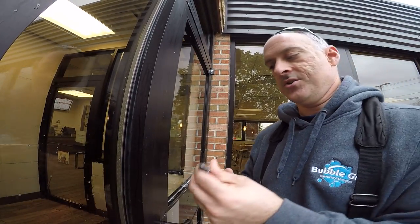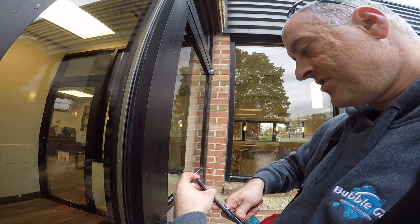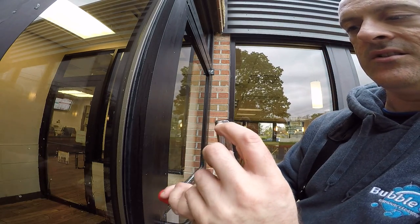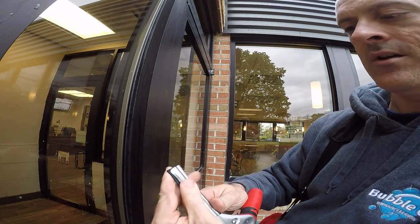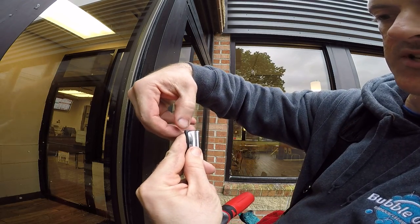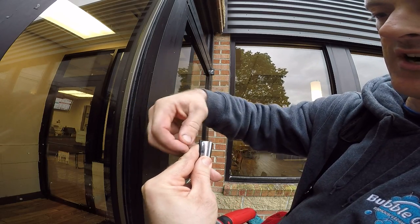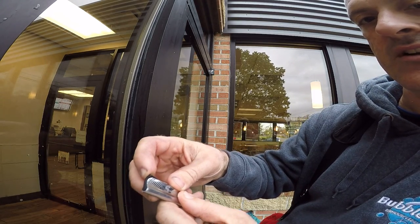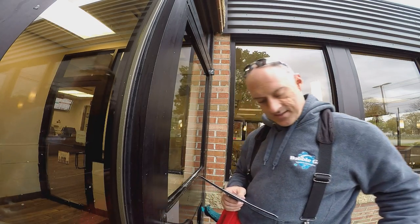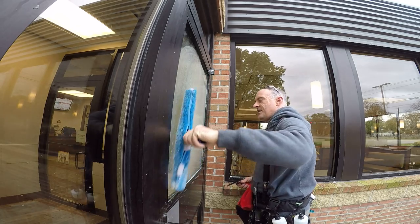So the question is: is that true? You'll notice that I have the rubber cut flush — absolutely flush to the ends right here, absolutely flush. Now I can already see that this is going to present a problem potentially. The channel is rounded, and this corner — this little triangle right here — sticks out past the corner. There's no support for it, and so that will potentially cause lines as you're turning. Let's test this out and see if this channel can also do the same thing.